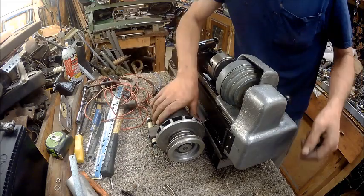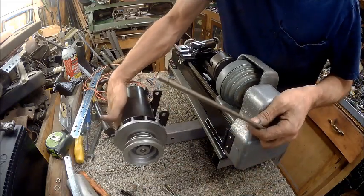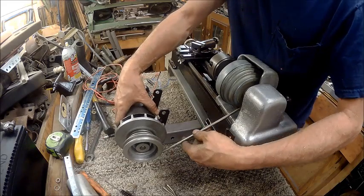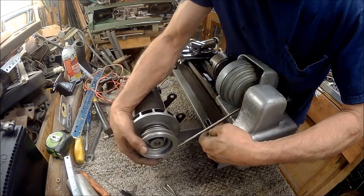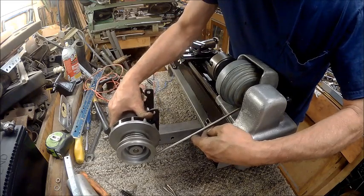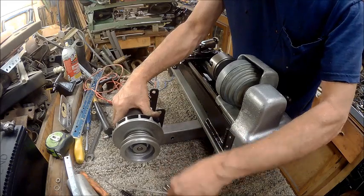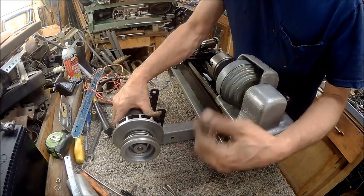That'll work. Alright, the weight of the belt — the weight of the motor starts around about right there. So I took this and mimicked the belt, and it looks to me like it's not going to hit the case. So right about there is where we want middle. The belt should be tight right about that area right there. That's where I need to lock it down to decide what size belt I need to use. We're going to use link belt, so I just need to get an idea how long this is with a rope so we can get the right size link belt.